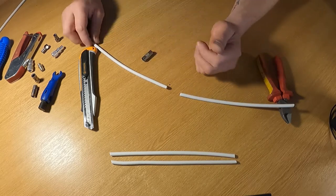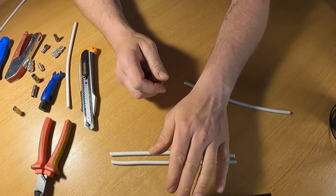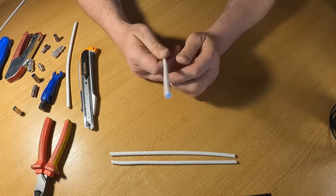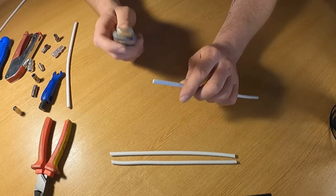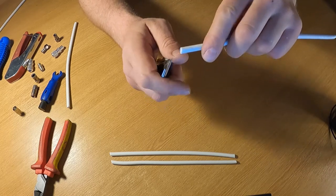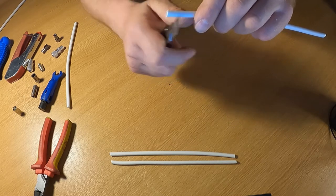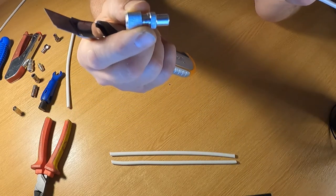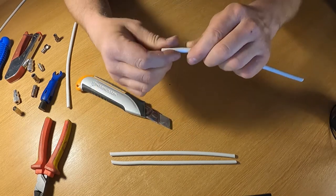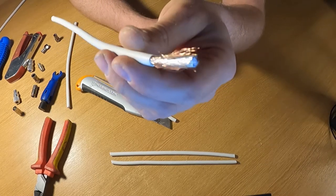Let's get into preparing cables. Starting with the most common DIY scenario - prepping a coax cable for a TV coax connector. Take a sharp blade, come down just over an inch, watch your fingers. Score the cable right around and pull that first rubber sheathing off.